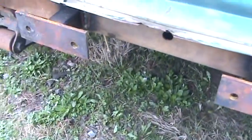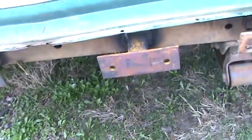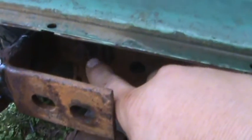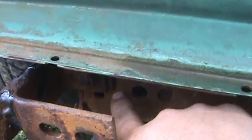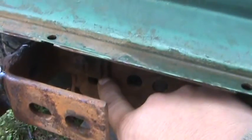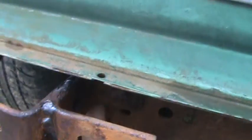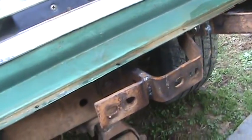That's why I went ahead and put those brackets on there. As for the new Jeeps, I ain't even looked underneath one. There's a bolt I cannot get to — I've tried, so I'm not going to cut that bolt off. Because it's boxed in, they must have put that on before they boxed the frame. I'm going to weld those brackets in two places — down the side, on the bottom, and on the back. If I ever mess this up, I can come in and cut it out with my die grinder and re-weld another one, because I can't get my hands back there to reach those old rusted bolts.